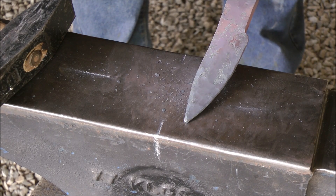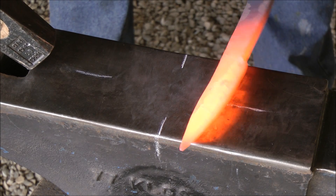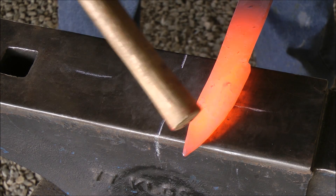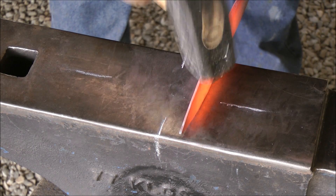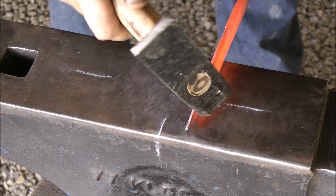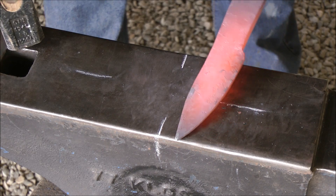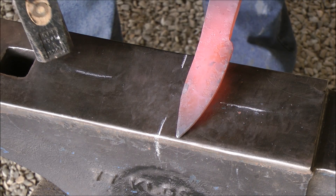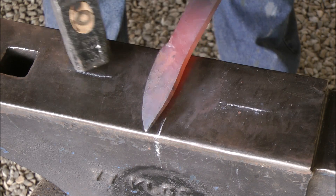My metal is cold, so I'm going back into the forge to continue working on my edge. Now you'll notice this little wiggly, waggly thing I've got going on the edge there. Just taking my hammer, hammering those in very, very lightly, making sure that my edge is straight — that there are no bumps. And then working that edge again.